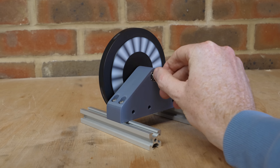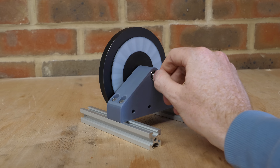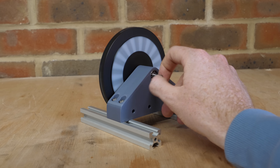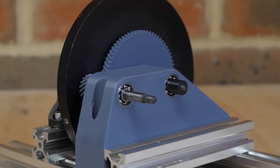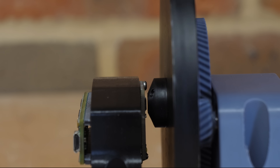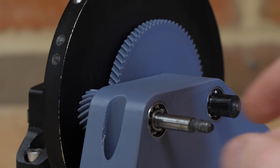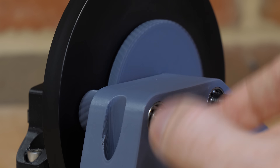Also, with the wheel being directly driven by the turbine, it might be a little dangerous having this thing spinning at potentially 20,000 RPM. So I scrapped this design and built another inertia dyno with a magnetic encoder that gives really accurate angular position and RPM measurements, as well as a gear ratio so the turbine can spin much faster whilst keeping the flywheel at a safe speed.